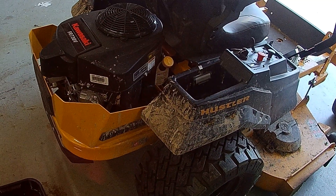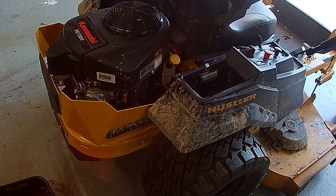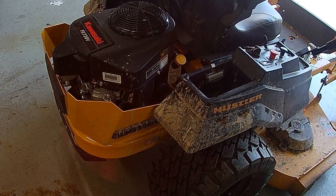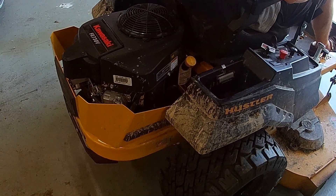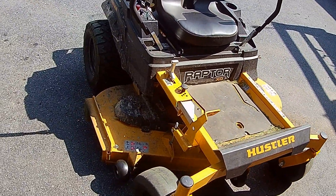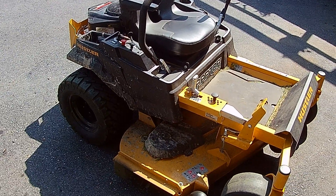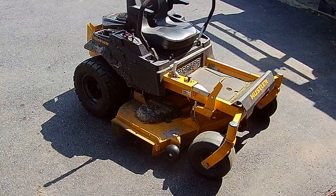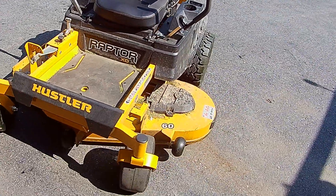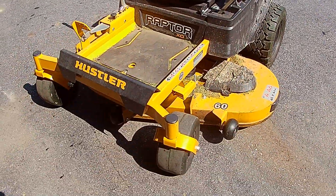That's the job basically done. Now all we have to do is put the guards back on — that's pretty much it. We'll clean up the hydro units and wipe off any oil that ran off. There you go, guys — that is how you service your ZT2800s on a Hustler Raptor XD60. It's really not a bad job. If you have one of these, don't wait until your hydros fail — just do the service. You need 20w50 and a couple of filters and you're good to go. Thanks for watching, catch you in the next one.